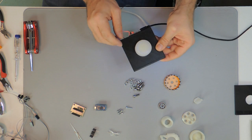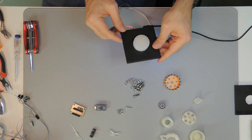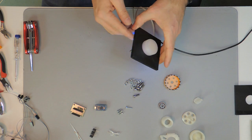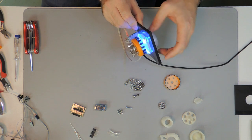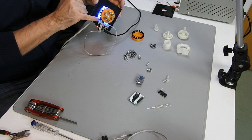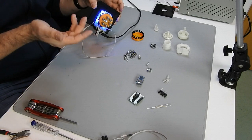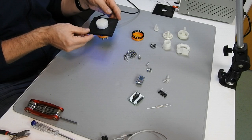And yeah, you can imagine this as a kind of one-dimensional mouse. It works relatively similar to one of the early mechanical mouses in the way that you have at the bottom some kind of flywheel and encoder wheel, and by turning the knob there are optical sensors that recognize the motion and transfer it into electronic signal information that can be processed by the software, specifically by the game.